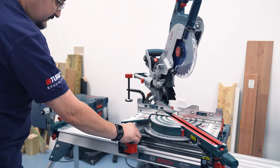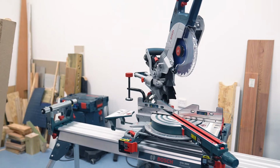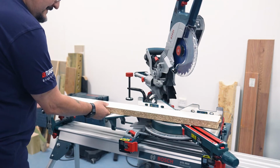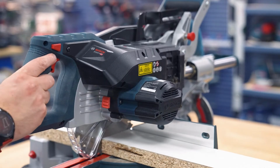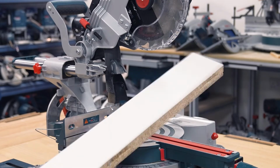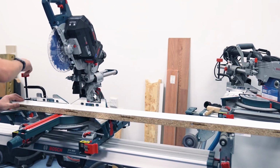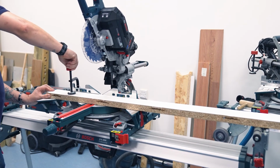Handling long material: make sure you have adequate support accessories such as clamps and table extensions to accommodate workpieces longer than the tabletop. Pieces longer than the mitre saw table can tip if not securely supported. If the cut-off workpiece or workpiece tips, it can lift the lower safety guard or be thrown by the blade. Do not use another person as a substitute for a table extension or material support, as unstable support for the workpiece can cause the blade to bind or the workpiece to shift during the cutting operation, again pulling you towards the spinning blade.